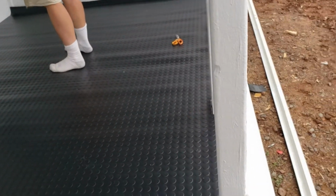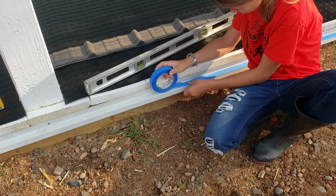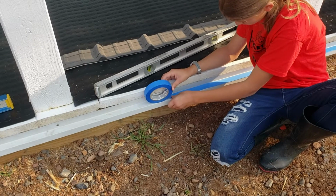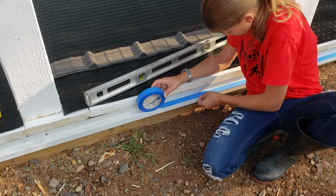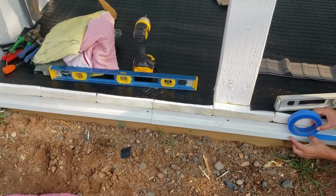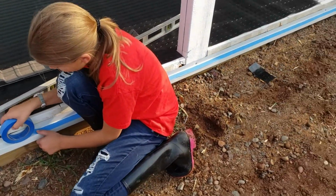And then it's time to put the polycarb up, which is 5 panels, and I'm screwing them in to manufacturer specs, which is a lot at the bottom, a lot at the top, and then every other ridge. We did put down a bottom edge so that I can stop mice from coming in. And on this bottom edge of polycarb, I'm also putting a foam strip in just to insulate it. At the top, I'm going to put a foam strip in, and then as you'll see, I'll put the cap on it to keep the rain and stuff out from the top. Believe it or not, it's just hours before a storm hits, so we literally get this up, and then we get to see how waterproof we are, and it turned out to be great.